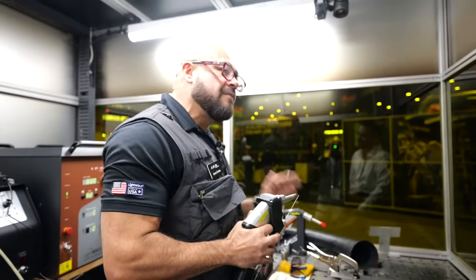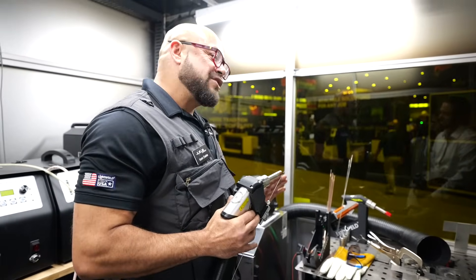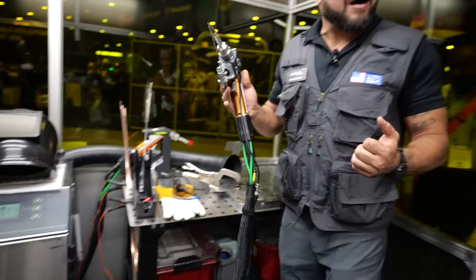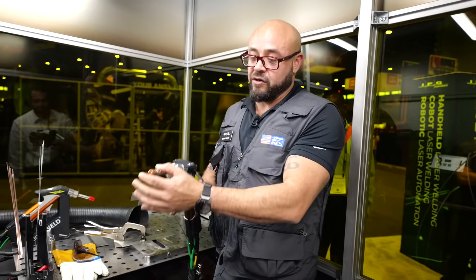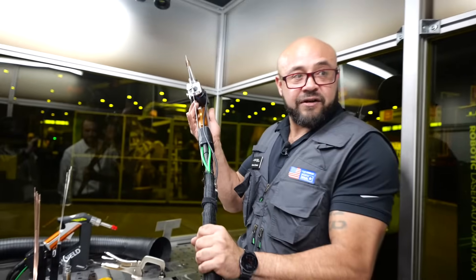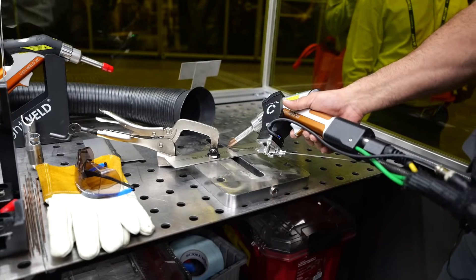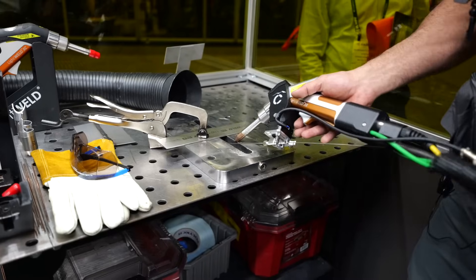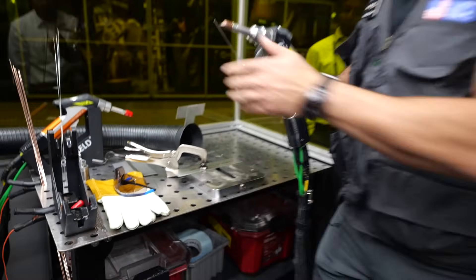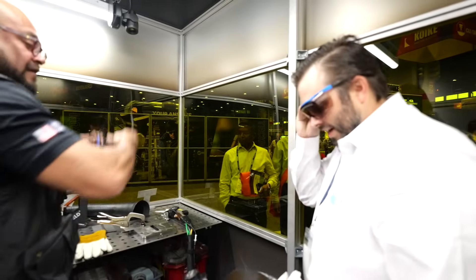The stance is just a little bit different than TIG welding, but it is super easy and anyone can do it. Actually, the less you know, the better you do. So I'm going to walk you through the stance. Your goal is to make sure you put just enough pressure to keep it in that little channel. Grab the handle right here, put it right into the joint, give it some gas. Once it starts to blink, pull the trigger and hold it. It's going to push against you, and your job is just to let it guide you. As soon as it exits the material, it's going to shut itself off. Let's go ahead and get suited up — you're going to need your glasses and some gloves.